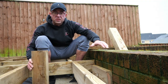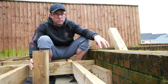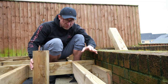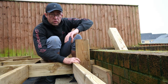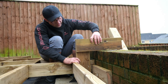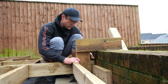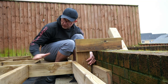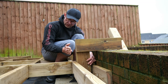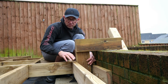This is the wall and the decking is going to come up and over. I don't want it touching the wall because of moisture - over time condensation will build up and probably make the wood rot. So I plan to attach a board running down here, and the overhang will start here. I'm going to put another board on the front - the decking runs up to it, then there's a gap underneath. The board runs along here, the decking board runs up and over the top of the overhang.